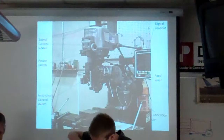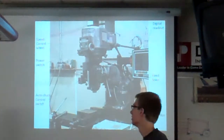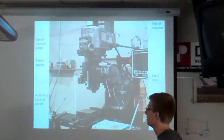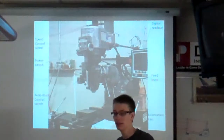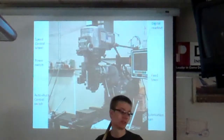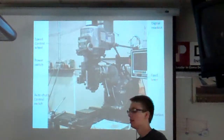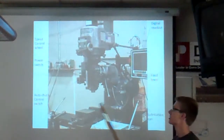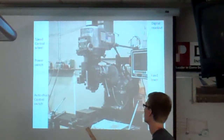With a hand drill, you kind of just grind it in. Precision is the name of the game, and as we go through the other pieces we'll emphasize that a little bit more. There are three levels of precision: hand drill, drill press, mill. Mill being the most precise. If you need to be perfect, you would use the mill. So that's its main purpose.